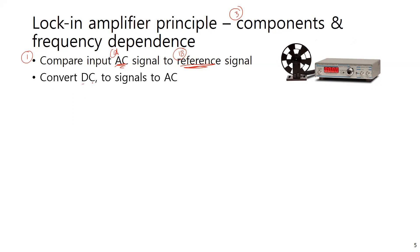If you have a DC signal, it has to be converted to AC. One way to do that is electronically. If you're working with optics or a laser, you can use a chopper wheel — in the YouTube video you'll be watching, they use a chopper wheel to modulate a light signal from a diode, making it an AC signal. With an electronic signal, you might use a summing circuit where you feed in a DC signal with a known AC signal, modulating your input at a known frequency.